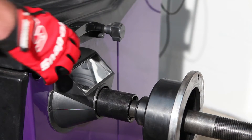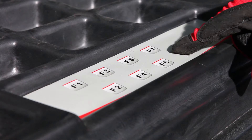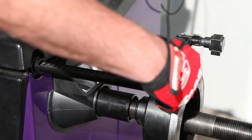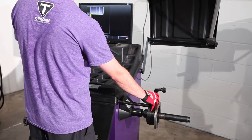Take your ruler handle and place it flat on the bolt on the side of the machine. Press F8 to save that position. Extend the ruler handle out to 20, which times 10 equals 200. Press F8 to save that.